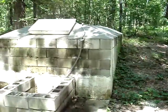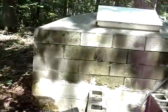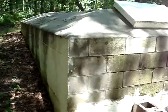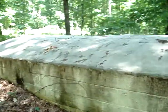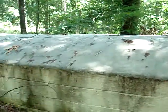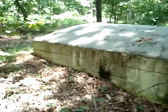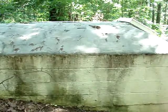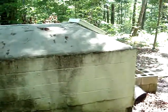This is the 3,000-gallon holding tank. We're up the hill from Bob's house. It's about 8 by 16. I helped him form the roof with rebar and foam board, then stuccoed over with a stay-dry lining. This is filled with the photovoltaic-powered pump from the spring, and then gravity feeds back to the house.